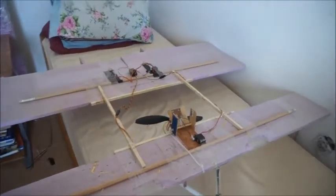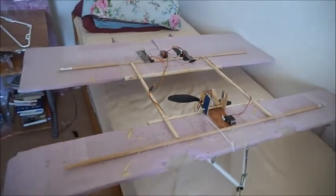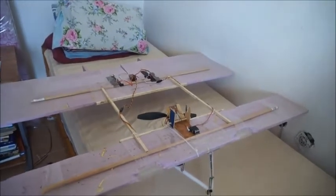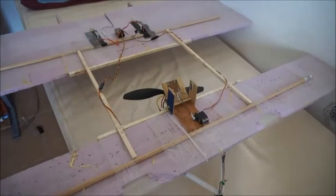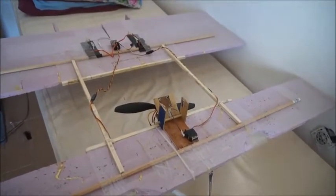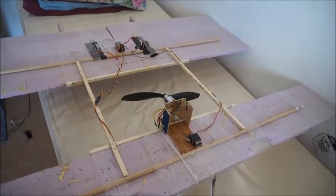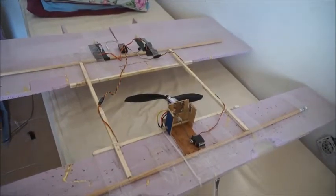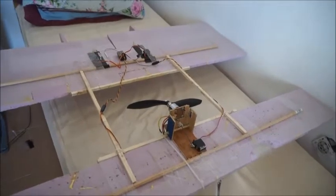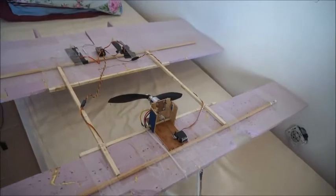So I was kind of shocked, and felt a sense of gratification when everything worked out as expected. Once again, for the takeoff, this engine bay is rotated 45 degrees down. It's a pusher prop, so that gives a vertical component of lift. And then immediately after takeoff, the engine is put to the full forward position, because otherwise it becomes very difficult to control.